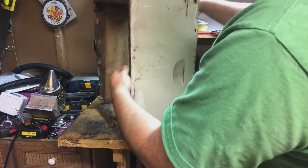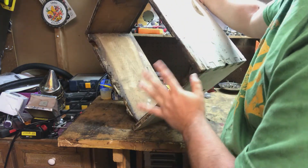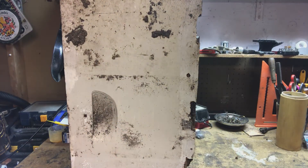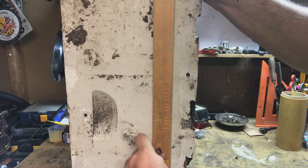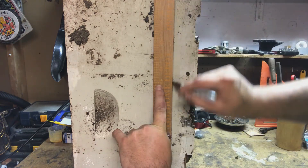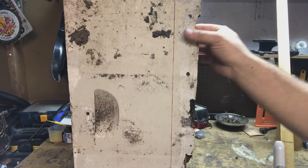Our goal is to cut the rotten parts off and preserve the good ones. It looks like somebody patched this box before — here's a patch that still appears pretty sturdy, so we might put a couple screws in it. One of the tricks I follow with rabbeted boxes: rabbets are these teeth in here. You connect from tooth to tooth, and that gives you a great straight line between those two surfaces. That's where you're going to cut — you want to cut above the rot.